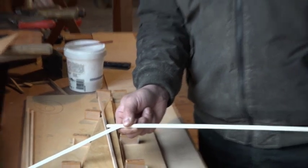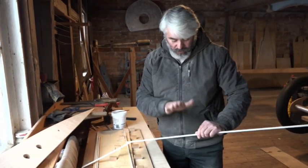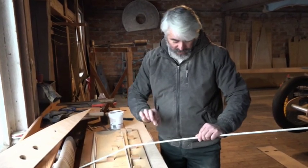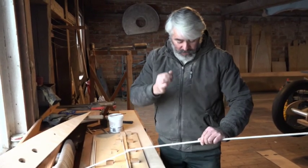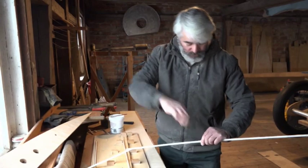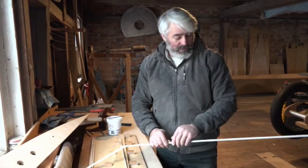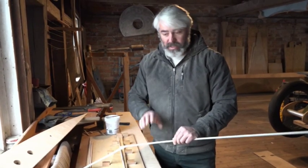In the entire unglued area, when you have laid the fabric on, you can, with an upholstery needle, stitch the fabric on top of this wrapping step by step, until the fabric cover of the rib is stitched to the rib through the rib cap strip wrapping.